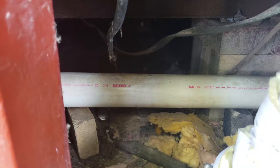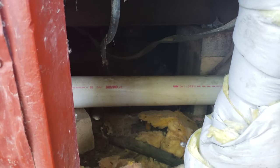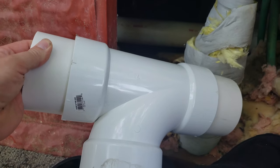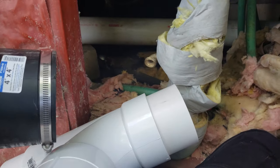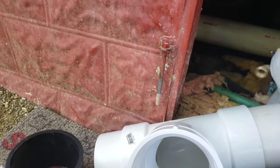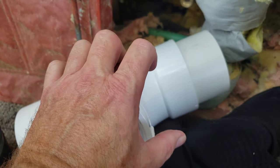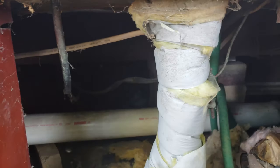Here's the sewer line again — it's marked four inches, four-inch pipe. I'm going to cut a section out of this pipe with a sawzall, matching the size of this assembled PVC pipe I bought from the local hardware store. I'll attach them to the existing cut pipe with these sleeves — they're plenty strong enough. Here's my inlet: it has a screw-in portion with an RV hose end so I can dump straight into my existing septic system.